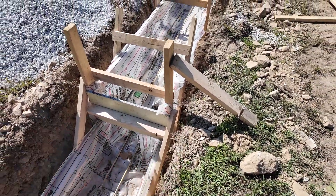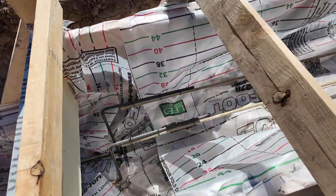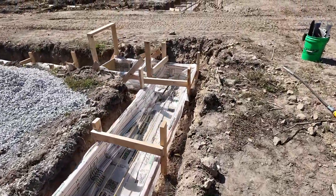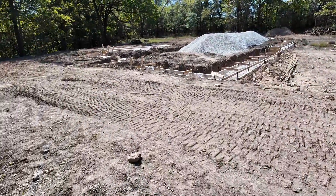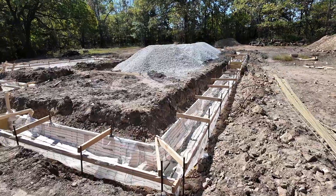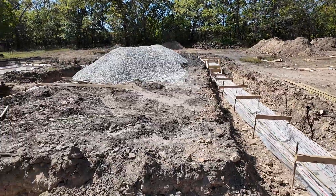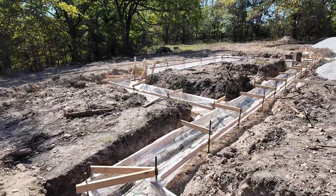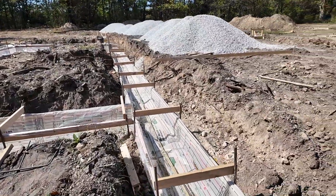There's a piece that goes right here, kind of loops in — these are 16-inch deep steps. You'll see in the detail here it's kind of weird: we used steel to make our bins and then we use gator bar. Funny thing is the municipalities are all different about fiberglass. Most of them are very enthusiastic about it — it's a very nice product — but they want to know every brand, manufacturer, and all the data on it. So MST is our preferred bar because it's got more of an epoxy coating, it's textured, and it's shaped more like steel rebar.